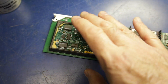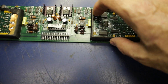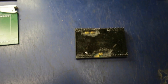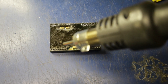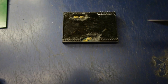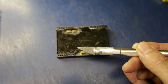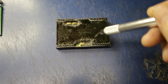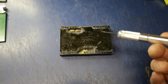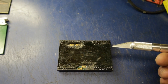I've already got this one totally repaired and back together, so I'll show you what I did on the bottom side. I've covered the epoxy removal on another video, but I'll cover it briefly again. I use a reflow station set to 750 degrees Fahrenheit, moving around a small one-inch area for about 30 to 45 seconds. Then I use an X-Acto knife and chip away at it — it becomes rubbery, and in some cases brittle as it hardens back up. You have to repeat the process and keep going at it. When you get down to the components, be very careful because capacitors and resistors can chip pretty easily, so work slow and meticulous at that point.